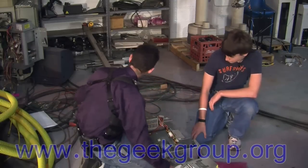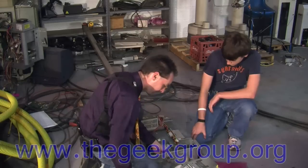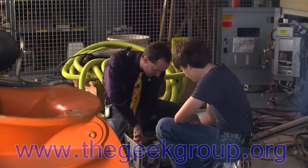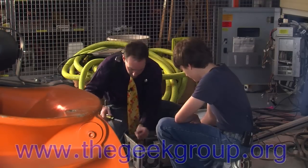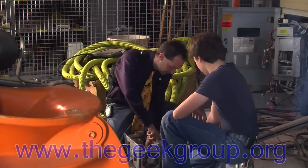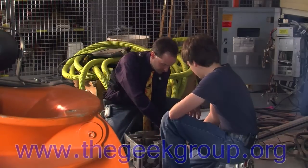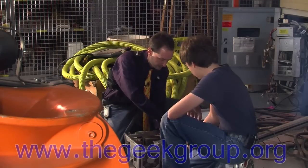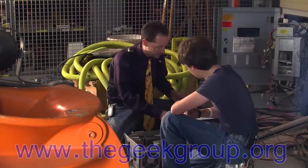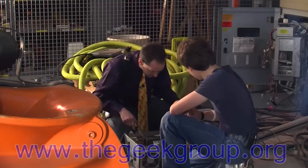Okay. Grab my number two Phillips, and now I'll take the motherboard. No, these are all number one Phillips. That's annoying. Most computers are built with number two Phillips screws everywhere. Yeah. Now the CPUs on these run off 24 volts DC. You can see that's the input power there. But beyond that, it's just a regular computer power supply.